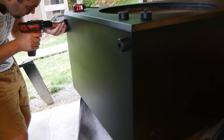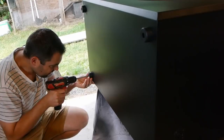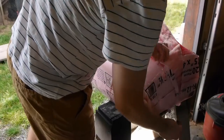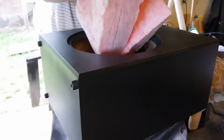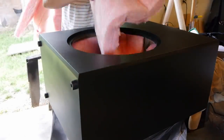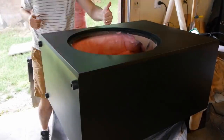I attached some rubber feet — these are pretty standard type of feet that I use on subwoofers. They hold the subwoofer still, they're easy to install, they get it off the ground a little bit, and it looks really sharp. I debated using five feet just to spread the weight a little bit, but I ended up with just four. And then I used insulation for the batting inside the speaker box. It's a sealed box, so there's no worry about dust. The stud-width insulation felt really snug inside and worked out really well. A lot of people use denim insulation or polyfill, but regular pink fiberglass insulation works really well for this application.